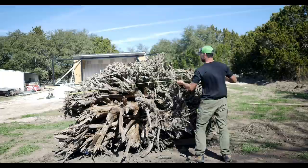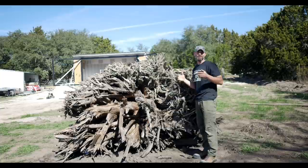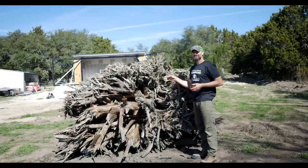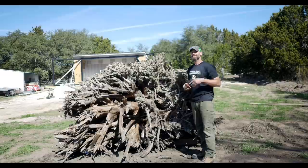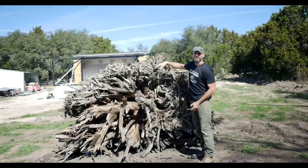Yeah, without a doubt. So my eyes aren't too bad yet at my old age of 43. It was about 98 inches. So no doubt about it that we need to rotate this log 90 degrees and we're gonna gain about 20 more inches of cut material to give more lumber back to our client. And we don't have to trim for the cut capacity of our sawmill.